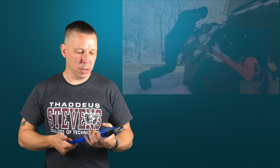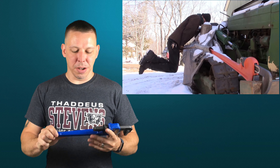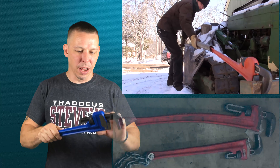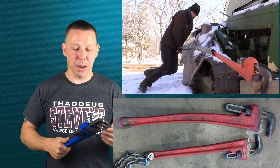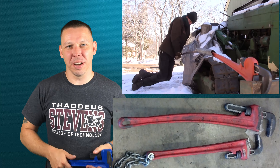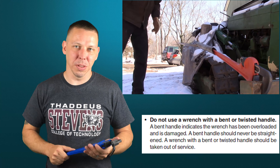You want to avoid the same things I discussed with Allen wrenches and combination wrenches — don't put an extension on it. If you work somewhere with a community tool set, chances are you'll see a pipe wrench with a bent handle because people put a long piece of pipe as an extension on the handle and stand on it. You'll definitely see pipe wrenches with bent handles because people aren't taking care of tools that aren't theirs. They're self-taught and don't know you shouldn't do that until the handle already bent.